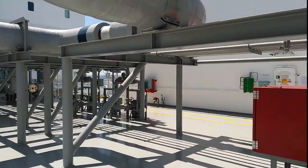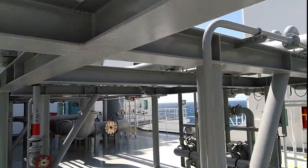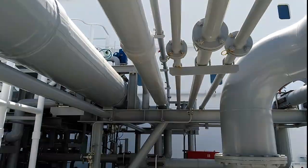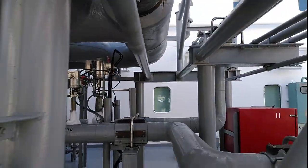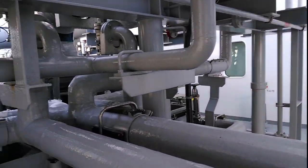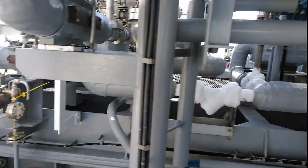Right here is liquid dome number four. You may also see the dry powder fixed system cabinet — if you haven't watched my episode on the dry powder system, it's a good episode covering this fire protection system on deck. Arriving at the liquid dome of cargo tank number four, you can see there is also a sub cooler supply valve and the master valve for the spray line.